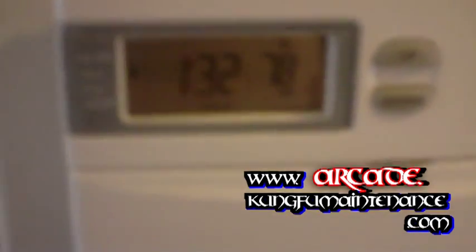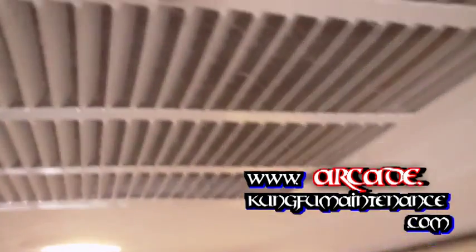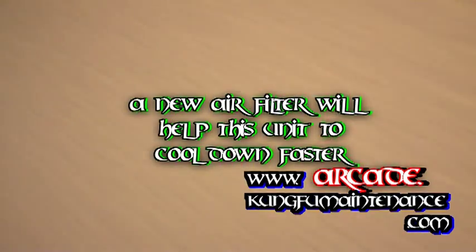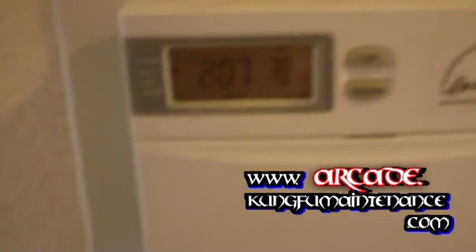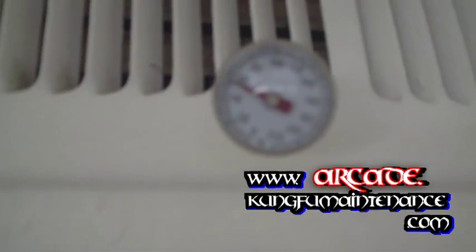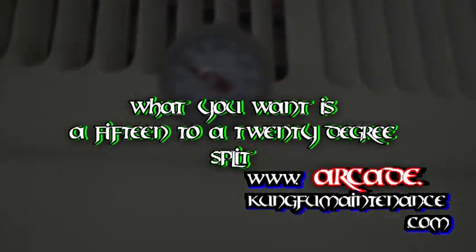So we'll give it about 20 minutes. It's actually been about 35 to 36 minutes. Anyway, I'm still showing 80 here going in at the intake. At the thermostat, the temperature has dropped to 80 from 84. I've got cathedral ceilings here so there's a bit of space to cool down, which is understandable. But you can see the outgoing register is a little bit under 60, so we're good here — we're holding the split.